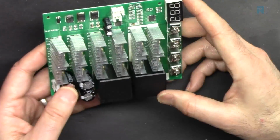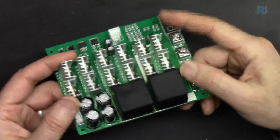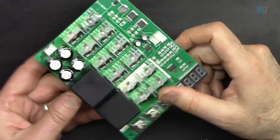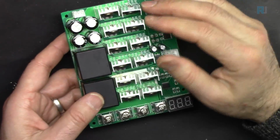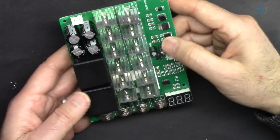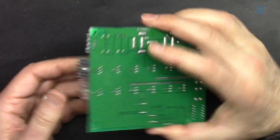Thank you for watching. This was the review of this BLH 89278 10 to 55 volts 60 ampere DC speed controller and direction control. So far when I've tested it, this does not support 60 ampere, because as soon as you have 60 ampere the temperature is increasing continuously, so I stopped it. And at 50 also the temperature was increasing. At 40 the temperature was increasing, but at a very slow rate, and it seems that you can use it up to 40 ampere, but not more than that.